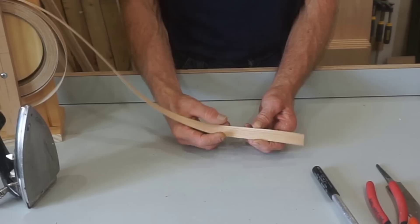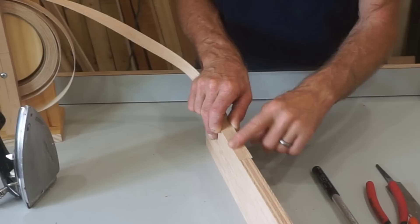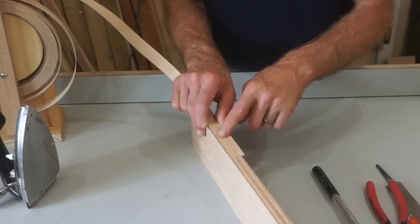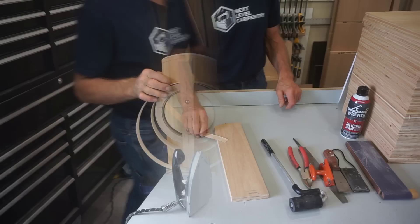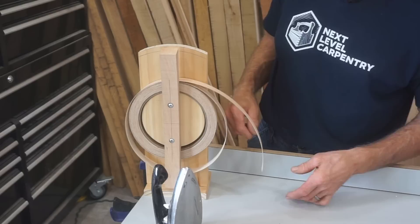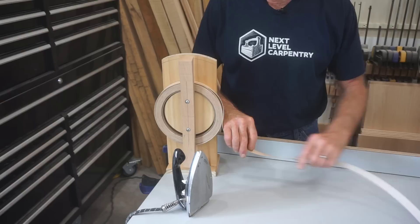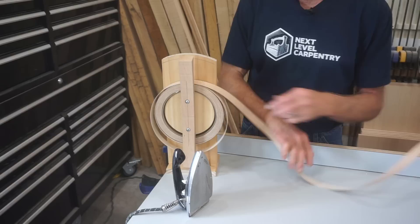Edge banding comes in various widths. This is about seven eighths of an inch, which gives me a comfortable overhang on this three quarter inch stock. If I'm doing half inch material, basically all I can buy is the seven eighths width, so I end up trimming off a lot more. They also have this edge banding in a two inch width for other projects. But seven eighths inch works great for this three quarter inch material. Because of the sheer volume for this project, I made this little tape dispenser reel. This just unscrews, I can put a full 250 foot roll on here, and when I pull this off it's coming off clean and straight. It lays on the shelf edge with those eight foot long cabinet sides — that's really important. If you lay this stuff down on a bench and uncoil it, it always comes off twisted.